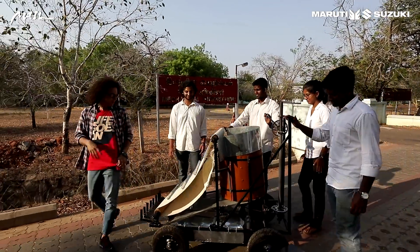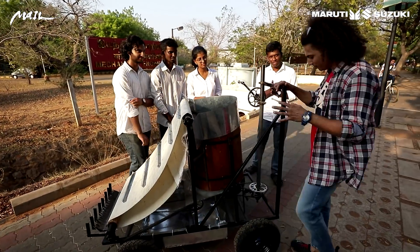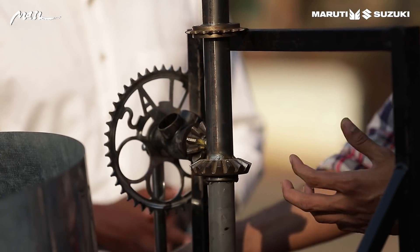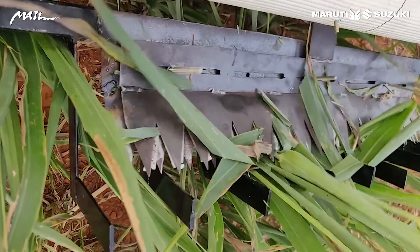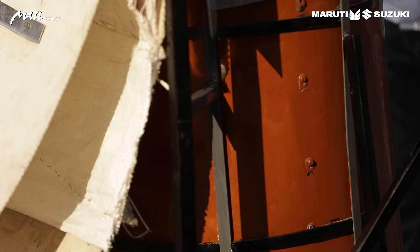This is our Reed Reapers. Taking a closer look at this machine, I see a lot of components from a bicycle here. The farmer just has to stand upright, push it and crank it simultaneously. Inside I see a lot of blades. The blades are stationary — they hit the crop and transfer it. When the machine moves, the blade moves and the crops get cut, go into this, the belt moves up, takes it in there, it gets threshed over there, then gets sieved over there, and then you have crops.